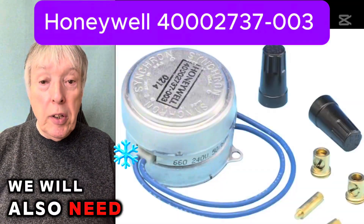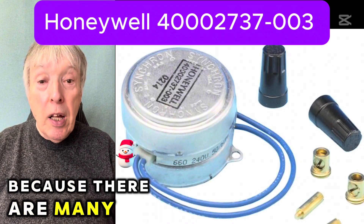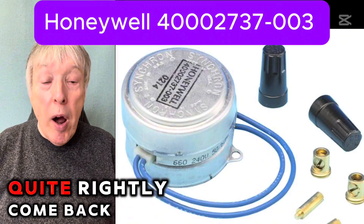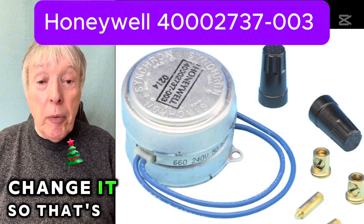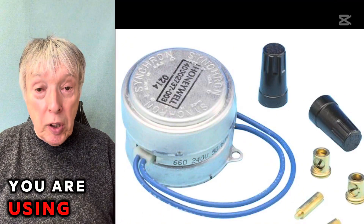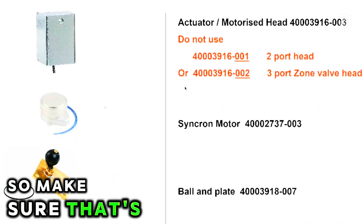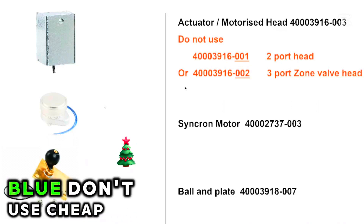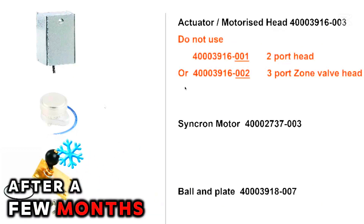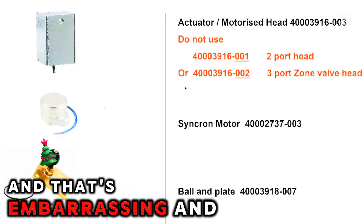We will also need a new synchron motor — make sure it is the one compatible with this particular valve, because there are many that are underrated with very low wattage. Those will burn out and the customer will come back to you under guarantee, which will cost you a small fortune. Always double-check and get the correct synchron motor for the valve you are using. The motor is Series 3, so make sure that's the one you use, and the wires should be blue — don't use cheap orange ones, because those motors are much weaker, burn out after a few months, and you'll have to replace them free of charge at your own expense.